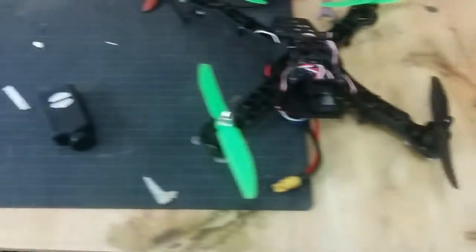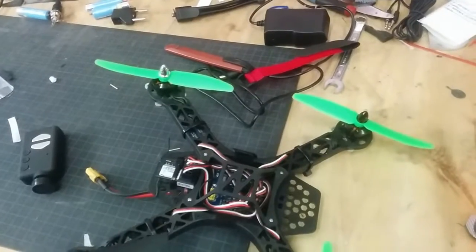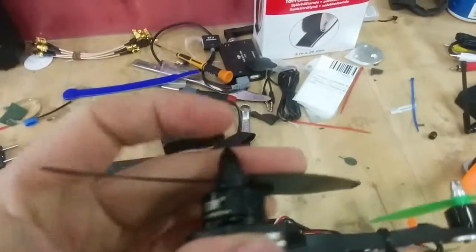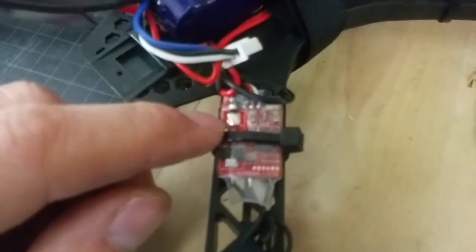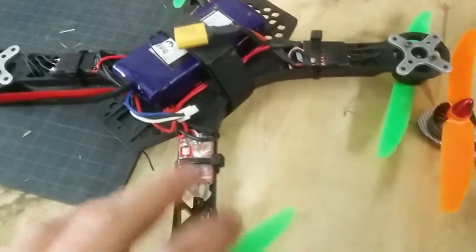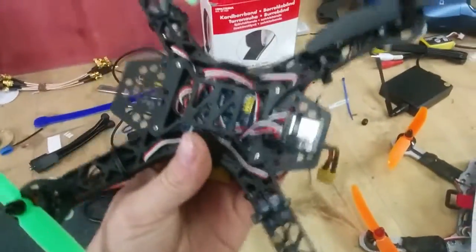I also built this small guy. It's the Hobby King frame. Really neat little machine, running with 5.3 props at the moment — with 5.4 it will be a blast. It's running with Mystery Motors 2300KV. I would say those are the same as the Emax; I have not done any measurements, but they are working really good. It's really really fast. I have to use mounting brackets below with only two screws, otherwise I could not fit the motors. The ESCs — the 5V regulator chip is removed on three of the four; the fourth one is actually broken as well. They were short-circuiting, so it's made up of some broken hardware I had lying around. MultiWii as well. Really really fast.